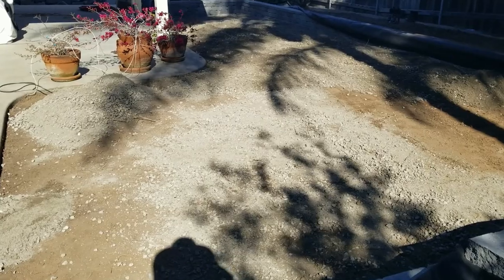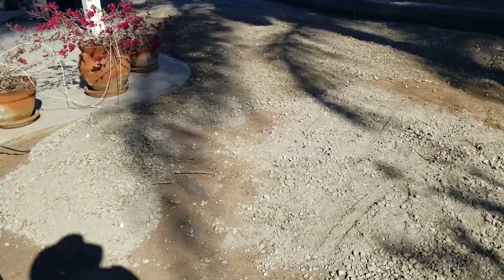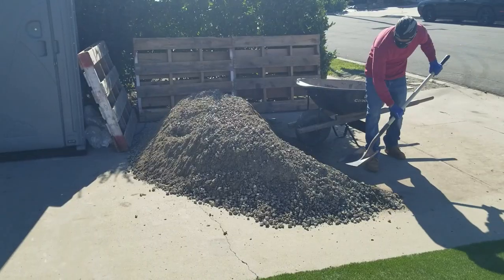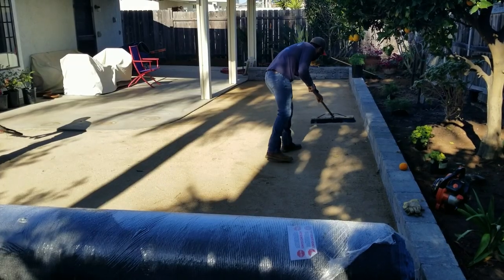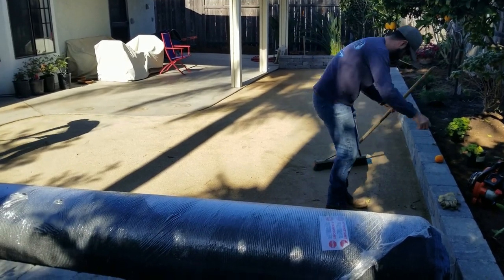So how is an artificial turf lawn built? You have to go down about six inches to remove all that material, then build it back up. First, you add compacted road base for really good drainage, because you need that drainage so the smell from pee and poop doesn't just sit on the lawn. After that drainage road base is installed, you add leveling sand to create a nice, perfect level surface for the turf.